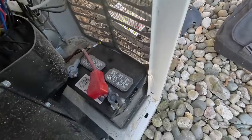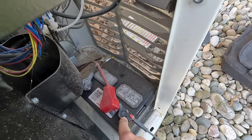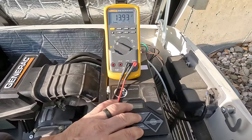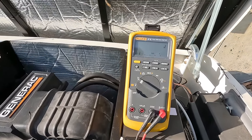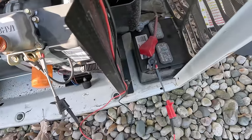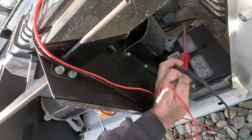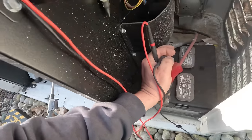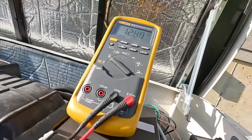So we have a problem with our actual battery connections between the positive and the post — the actual clamp and the post. Now that we went from the center showing that the battery didn't drop, let's go ahead — enter. Watch it now. Look at that — massive voltage drop. But when we went to the center post, we had voltage. You can check between your center conductor and your clamp and that'll tell you if you have voltage loss. Center to center, we're down to 12 volts, 11 volts. Yeah, things are taking a dump real fast.